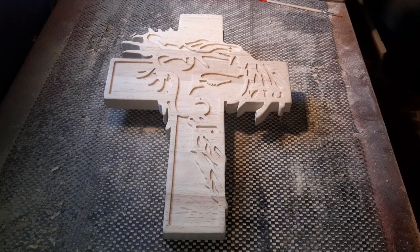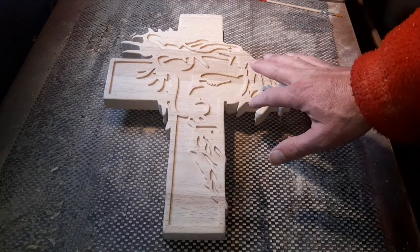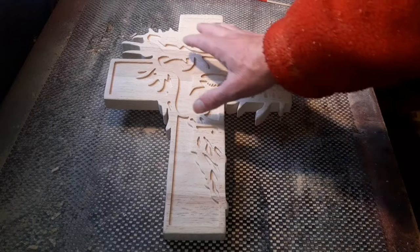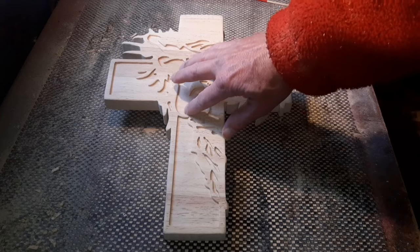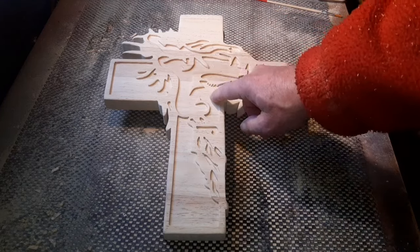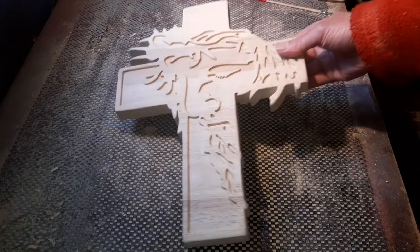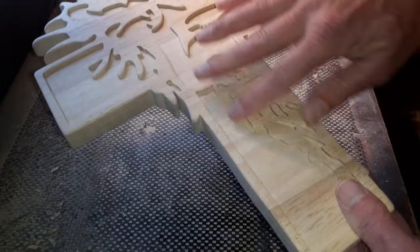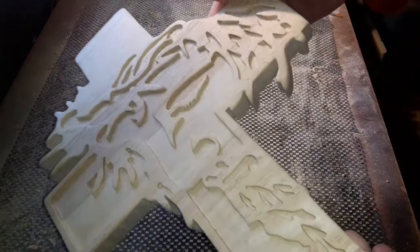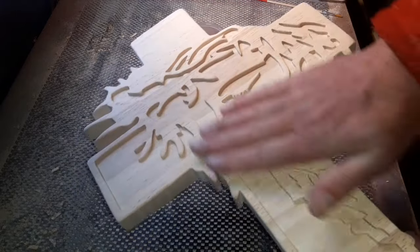Okay, that's enough general tidying up for me. Once we cut out on the scroll saw with our Pegas number 5 spiral blade, we came over with a mouse sander, and then we came in with the Dremel attachment there on the flexi cable, with an engraving bit, just to clean up inside those areas. And then good old sanding drums just around the edges off there. And then we use sandpaper just to smooth it off. So we've got no sharp edges, and you can almost just see from that, everything's nice and smooth, and we're still in one piece, so that's a good sign.